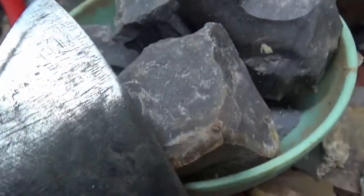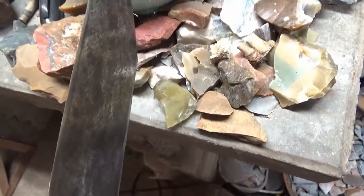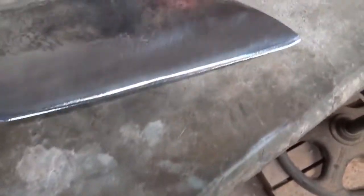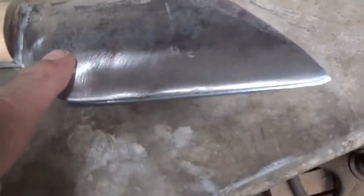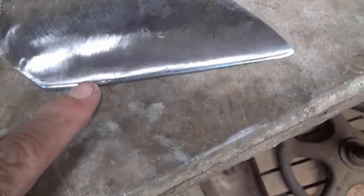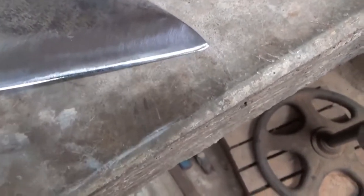This is a Filipino knife so it has an edge only on the right side because I'm right handed. I ground it down flat this way to about an eighth of an inch away — an eighth of an inch down to make it as even as I could. And then as I was grinding down, getting rid of the bevel, trying to make it as flat as I can, from right here down it's pretty much a straight edge, a straight long bevel down to the edge.